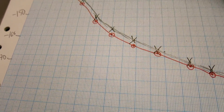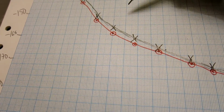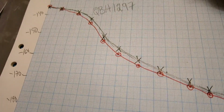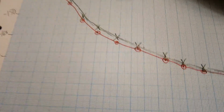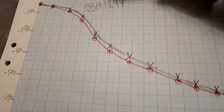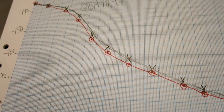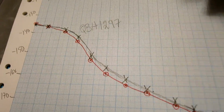And the capacitors are significantly bigger, but a factor of 2 should mean 3 decibels, and that's not what I see here. So I don't wish to proceed further with this. Probably the capacitors have some noise voltage across them because there is some leakage currents. And studying this in detail goes in a direction that I don't want to spend my time on. But the supply voltage is a very important factor with this kind of amplifiers.